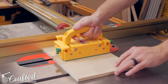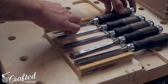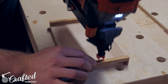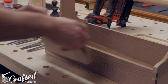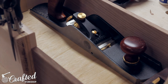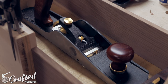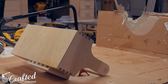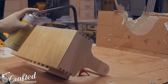With the structure of the tool tote finished it was time to work on the organization inside. First I cut some scrap maple to make a chisel rack, cutting strips of quarter-inch plywood to serve as dividers, and played with spacing until the chisels fit nicely without the handles banging into each other — glued and brad nailed onto the side of the tote. Next I cut more strips of quarter-inch plywood as dividers for the hand planes inside, added a little glue, and set the plane on top for clamping pressure. Off-camera I also created holders for my dovetail and crosscut saws by cutting blocks of wood with a kerf on the table saw, and a hanger for my marking gauge from scrap maple.